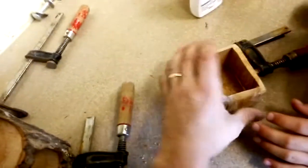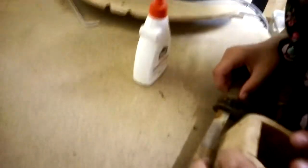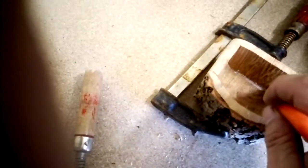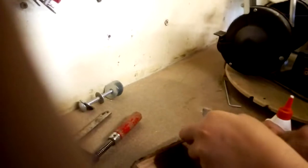I'm going to make this flush. Check the other side — other side's good too. You see how the glue is in there? Sometimes I take my fingernail or a little knife and just scrape it out. If the glue dries you won't really see it. So now we have to do this one — now you sand. A little bit of an angle like I showed you. You see the grain? The grain's out, so go like I showed you — a little bit of an angle, like this, and then you'll break it right off.